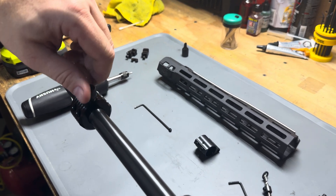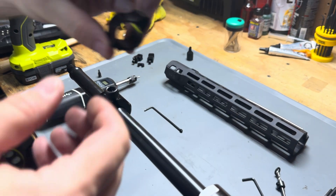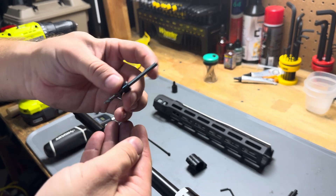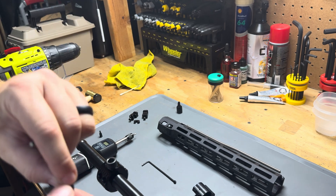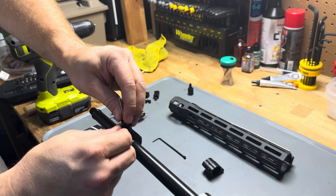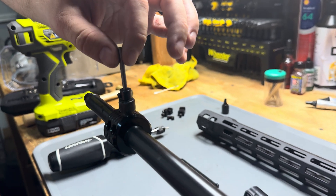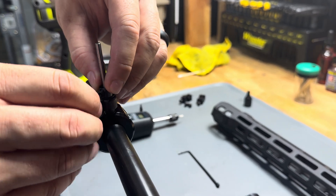This is where we're going to be drilling for the center, directly opposite, which will correlate with this screw right here. I'm going to need a sharp 5/32nd drill bit. I also use a stopping collar and a washer to help set the depth. I'm going to loosen this collar up, put this washer down, and let that drill bit touch the barrel. Then right on top of that washer, this is how we're going to set the depth.